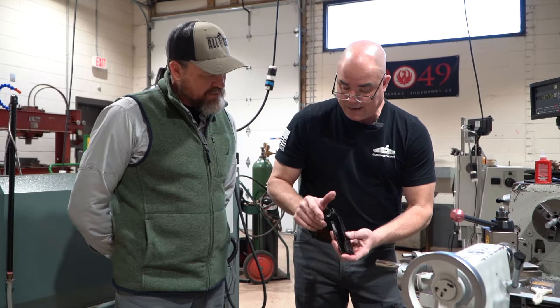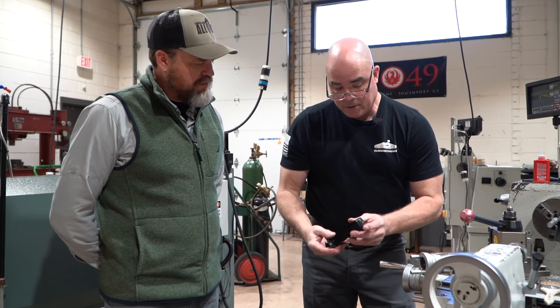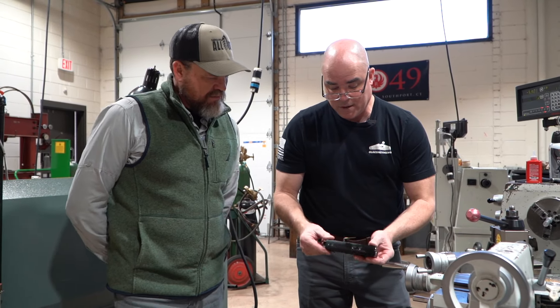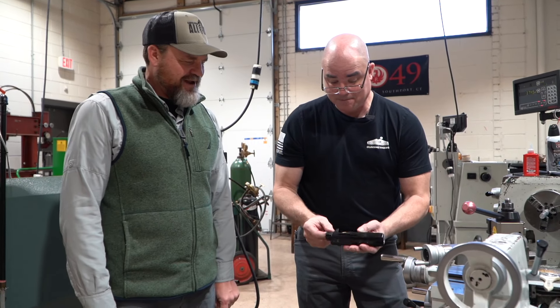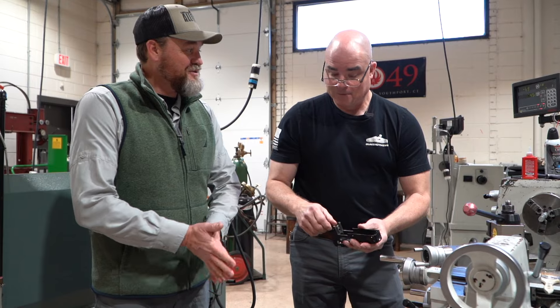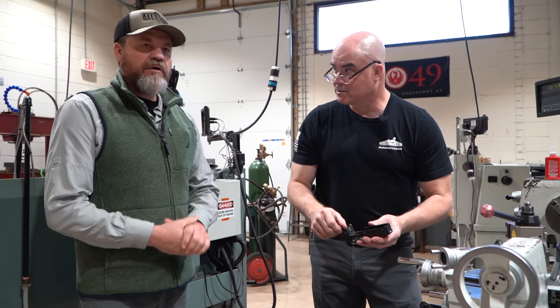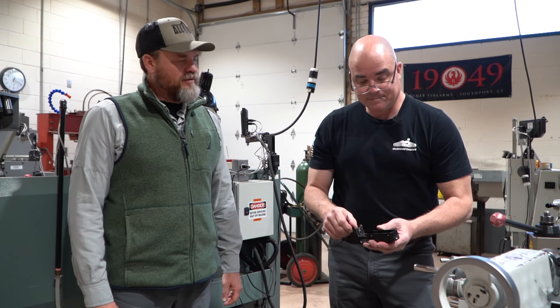The only other things we need to do to the receiver — we'll come in on the underside and use some Scotch-Brite just to clean that surface up a little bit, basically sand it for lack of a better term. That way the top of the bolt as it rides against it has a nice smooth surface. The more consistent we can make things, the more accurate the rifle is going to be. We'll re-tap these holes to make sure they're nice and clean.